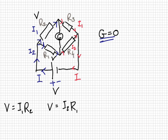And then here, is the voltage the same or different? At the top here, in this one. Is this the same V as this one? No, because it's going through another resistor, isn't it? So it's a bit like the potential divider. But at least we know the voltages here are the same. So maybe I should call that one V1, and V1. And this one here, V1, and then V1.